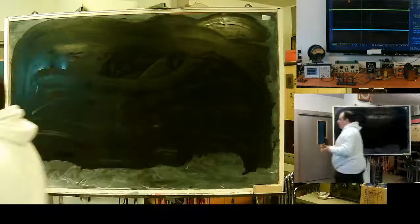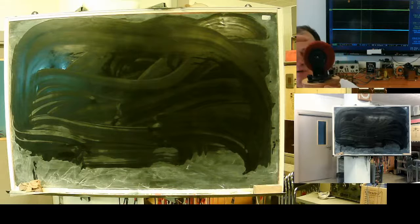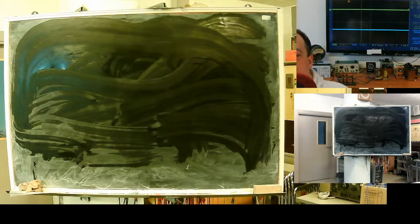The idea about such transformers: when we have coupled coils, it's like a simple transformer, and any outer influence can affect it. In the case of a toroidal transformer, magnetic flux goes around inside it, and the effect of outer fields is much smaller because anything that is induced here is balanced.